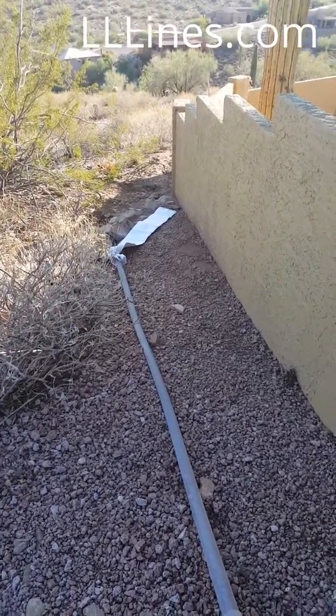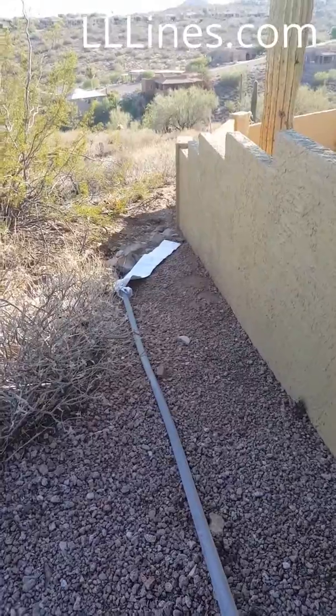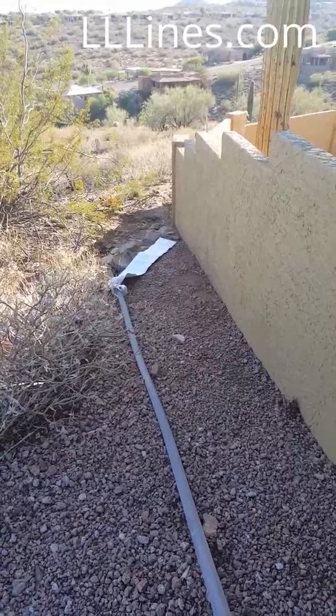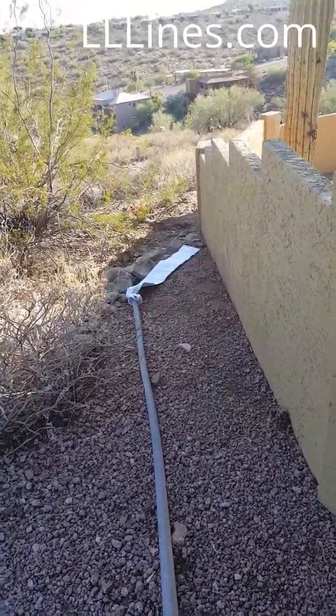The whole point of this sock — whether it's a sand filter or a DE filter — is it keeps the water right in place and captures all the debris. It prevents the rush of water that would wash away landscaping, and it prevents DE from going everywhere. So even if you are backwashing to a sewer cleanout, you could use this.